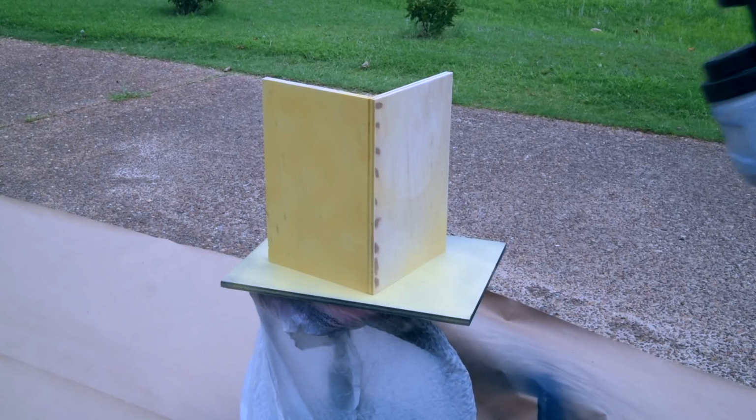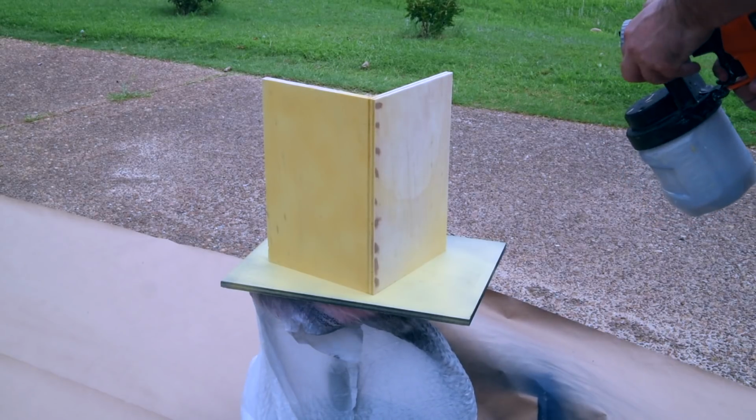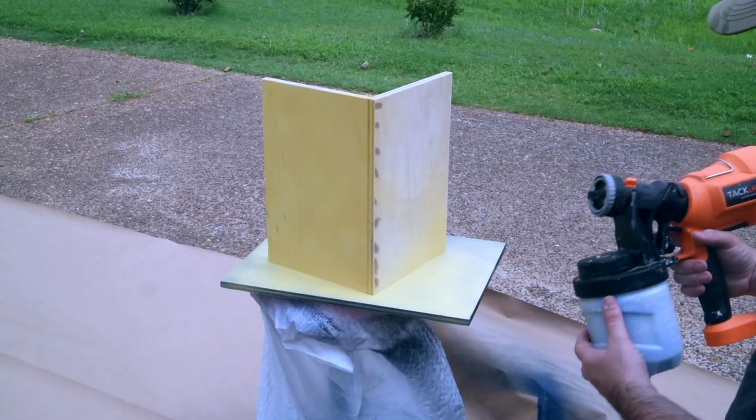And also just in investigating everything, what I thought was happening is the air that the sprayer pulls into the gun blows over the motor. So after you spray for about 5 seconds, it blows pretty hot air because the motor heats up, that's where the air is coming from. And you consider how thin the paint was and that I was able to pull dried paint right off the cover every time I sprayed it. I was thinking, okay, maybe what's happening is it's just blowing past the paint, pushing the paint to the outside walls of the nozzle, and then the superheated air is just drying it really fast because it's fairly thin. And I did find a lot of dried paint inside of it. So maybe that's what it is. So hopefully this thicker paint won't dry so quick and it'll do better.